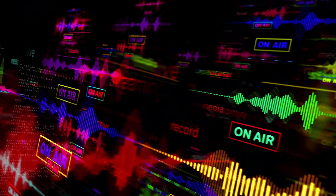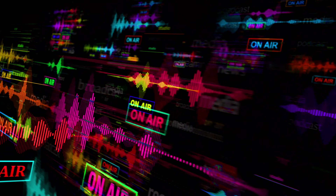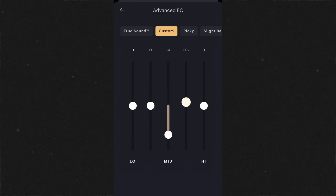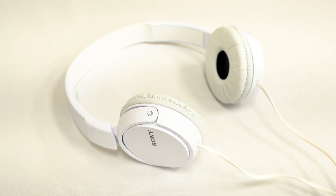Second, you introduce quantization noise — the audible error, a harshness or graininess that results from the computer's crude rounding of the audio data. It's the digital equivalent of a low-quality pixelated JPEG. This is the digital volume dilemma, and this is why audiophiles are so paranoid about it. They rightly fear that by simply turning down the volume on their source device, they are crippling the signal before it even reaches the high-quality DAC in their expensive headphones.